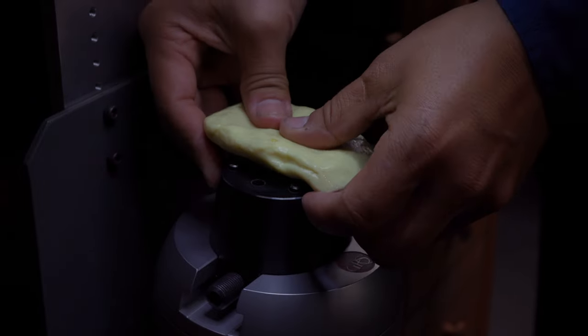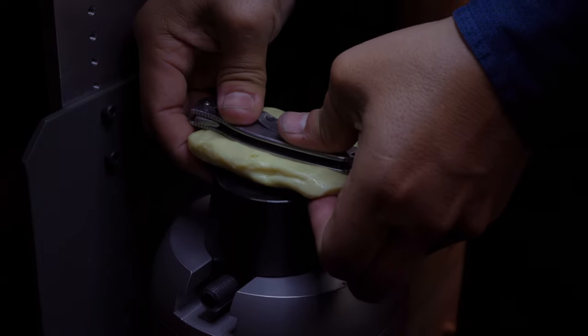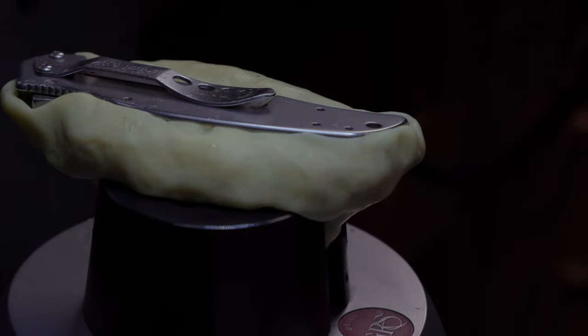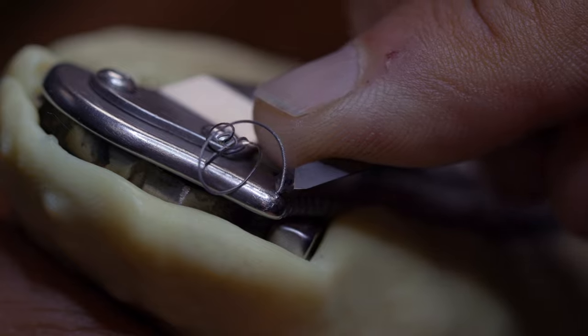Jet Set or Thermalock are thermoplastics. All you do is heat them up and insert your piece into them. When it cools down, it holds on to your piece without scratching it or marring. This can adapt to any piece you have, and in my mind is a must-have for engraving.